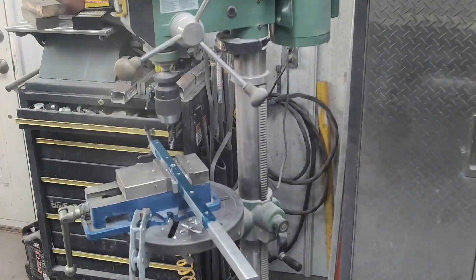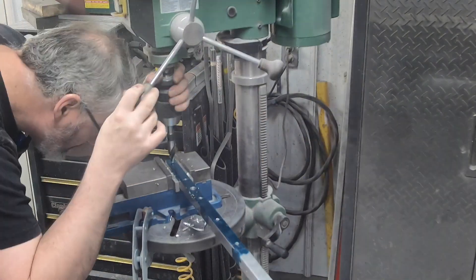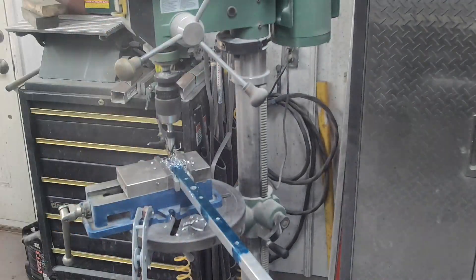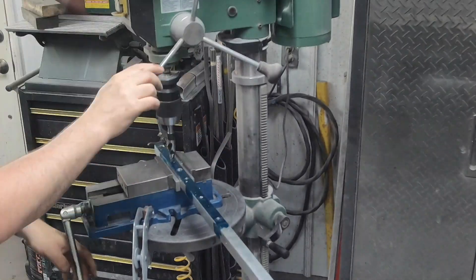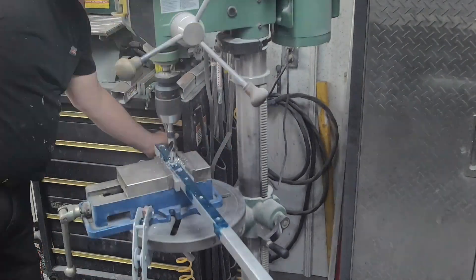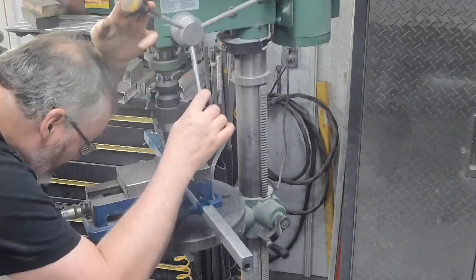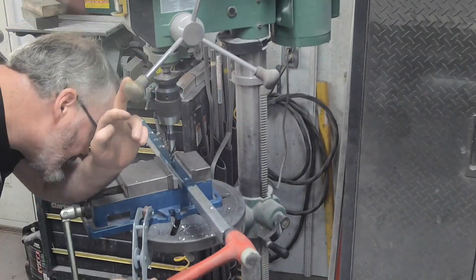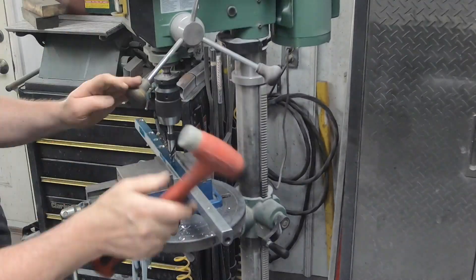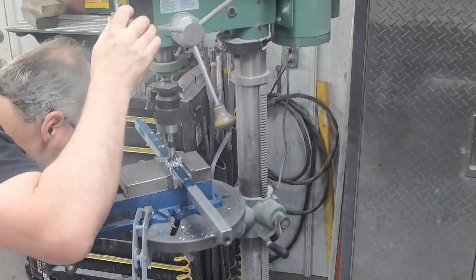Those that aren't full-time machinists will probably notice me doing a few things — one is spinning the drill backwards to center on the hole. I've drilled a pilot hole. Get yourself a set of stubby drill bits — don't be using jobber length drill bits all the time. They bend, they move. Stubbies don't. That's a special drill bit made specifically for drilling these injector ports, and it has to be turned quite slowly to make the whole thing work.